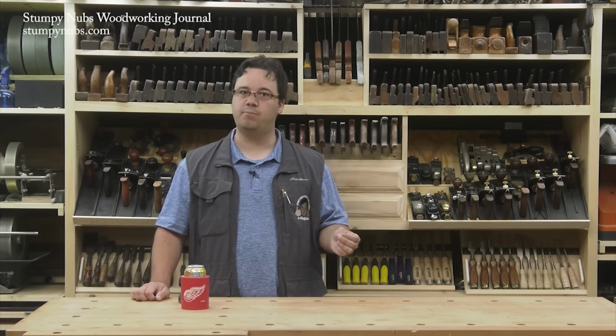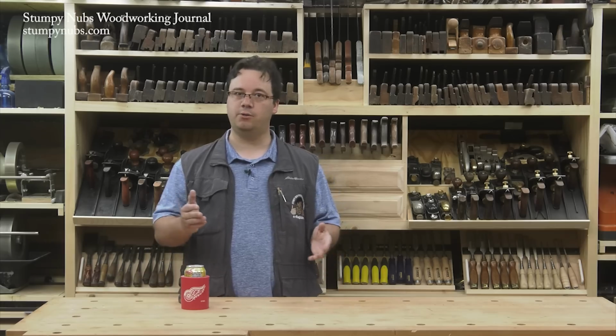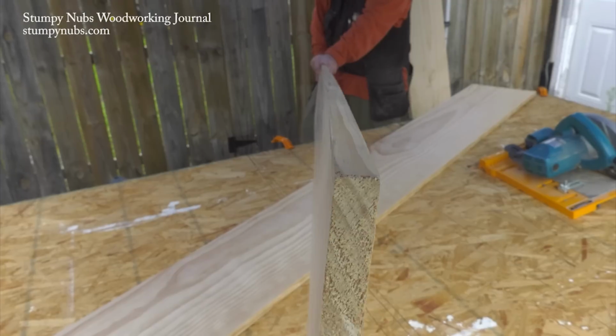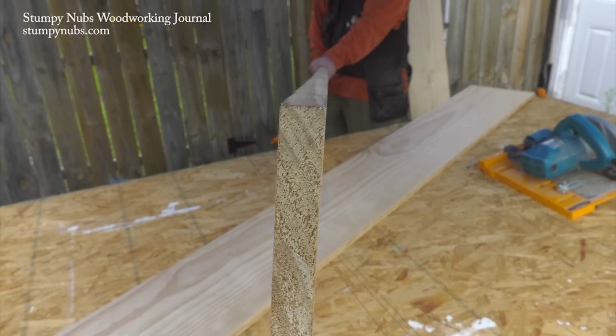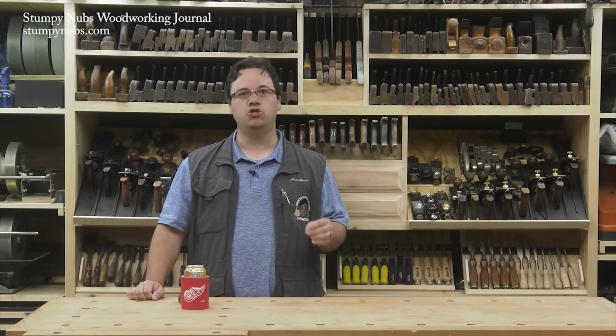You can buy standard pine if you like, but the more knots in the boards, the more likely there will be sharp bends and twists. Clear boards are usually flatter, and if they do cup or bow, the bends will be more gradual. As you'll see, you can work with gradual bows by forcing the boards flat as you assemble the project. Whatever you use, try to get the flattest, straightest boards available. Drive to more than one store if you have to.